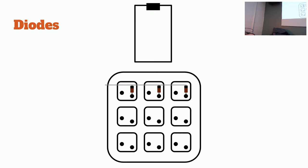While you're pushing the solder onto it? So yeah. What I would do is you put the iron on the side of it, and then you feed the solder from the other side over here. And that's the safest way of doing that.